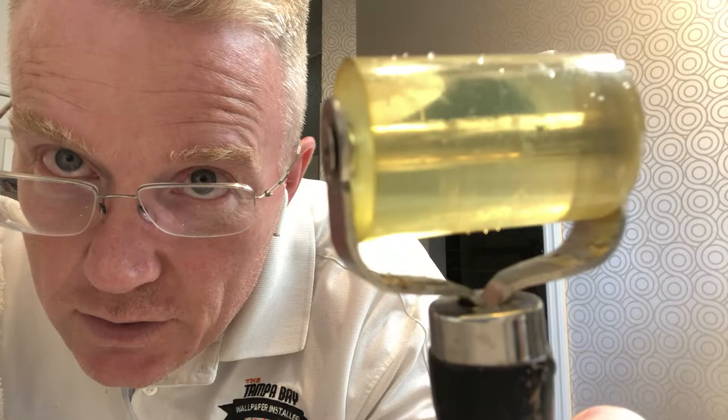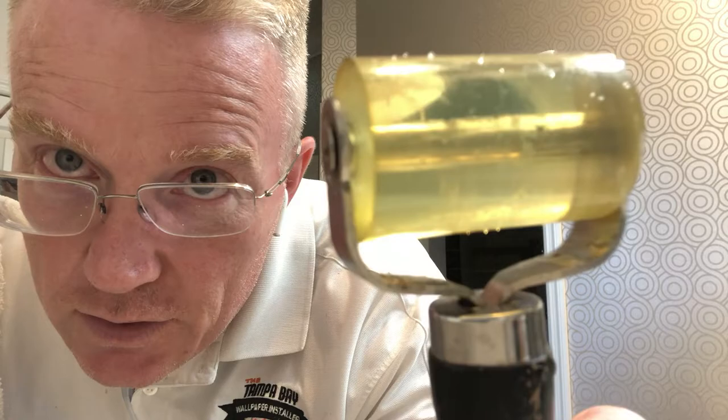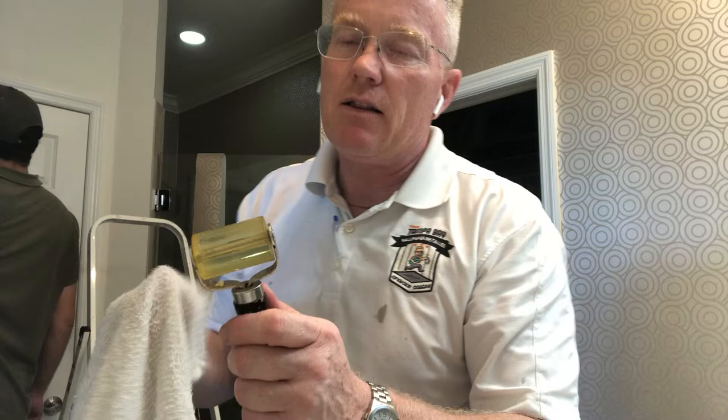Just look at the tip of the roller and you'll see the little glass beads stuck on it. You have to compensate with a procedure that eliminates that effect. But you still have to use something like this to get those seams to lay down. I suggested that you roll it pressing hard on the wall covering, but catching all of the beads. So that was one tip.